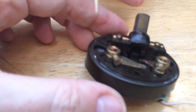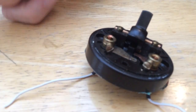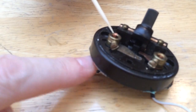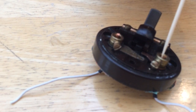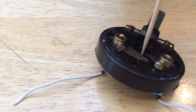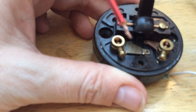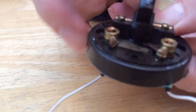You can see that on here — this switch is in the open position at the moment. The wire comes in here through that brass connector. The electricity comes along here, through the brass, through the copper, across here, out of that piece of copper, down here onto that brass terminal and out of that wire. Right in the middle of that switch the circuit is either open — like these two pieces of wire are now — or closed. And that's done by this rocker switch.